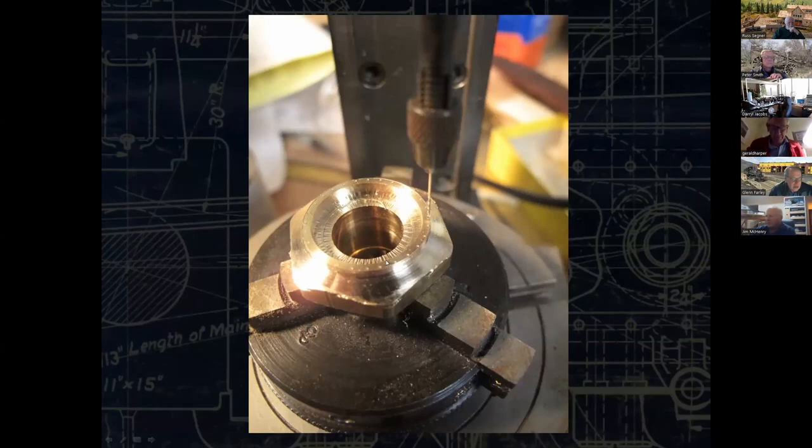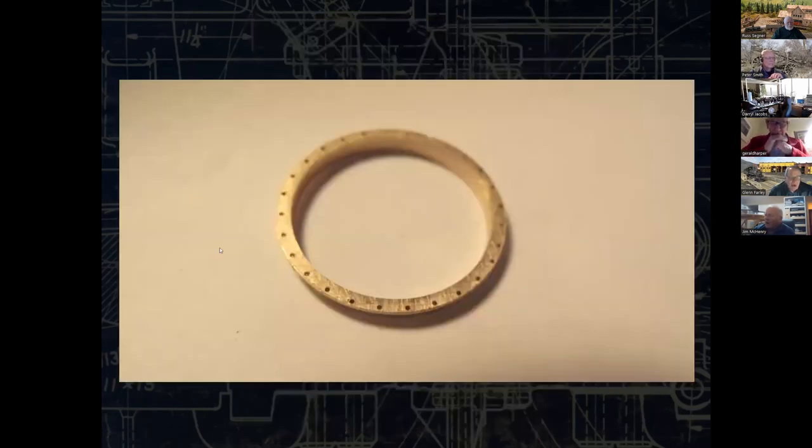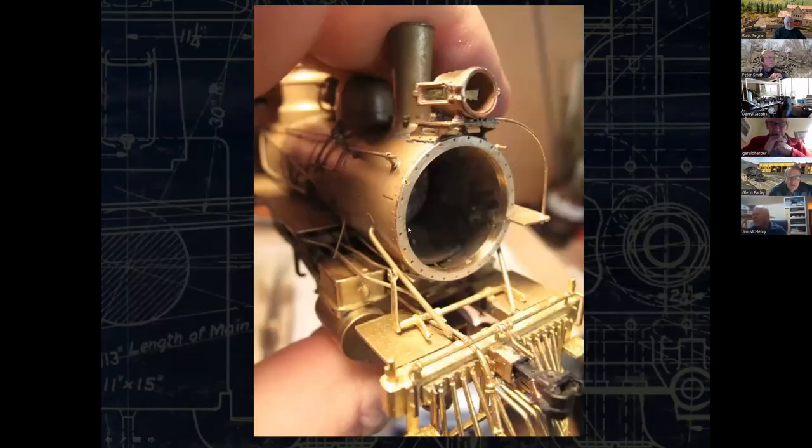The part is not done yet because I want to keep something to be able to handle that part. But this is the rotary milling table. So I know how many rivets or bolt heads I need here that will be brass. Figure out how many bolt heads you have in that circle, divide 360 degrees by that number, and that is the index you need between each bolt head to drill that out. Finally, when that is done, we end up with basically a ring. That ring is designed to fit in here. The other ring for the C-19 only came about to half of that width. This is coming out the rest of the way.